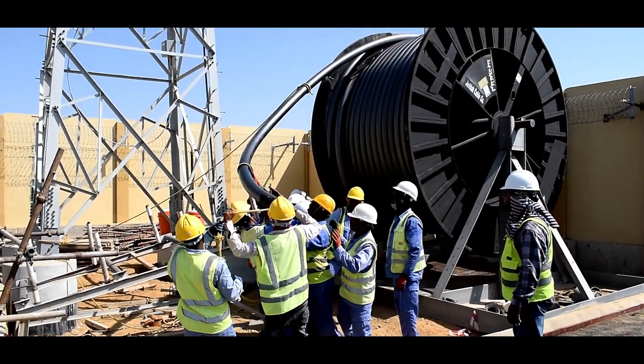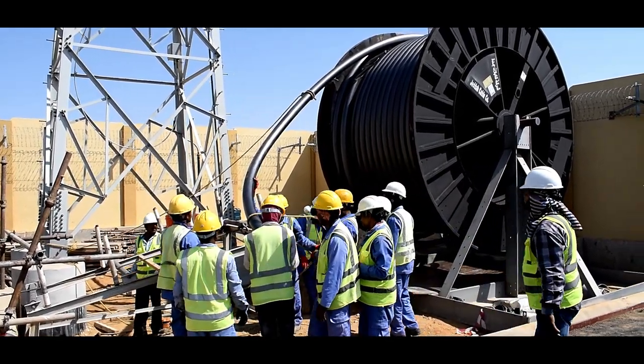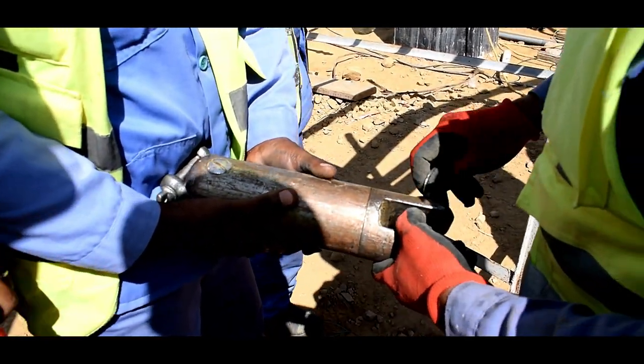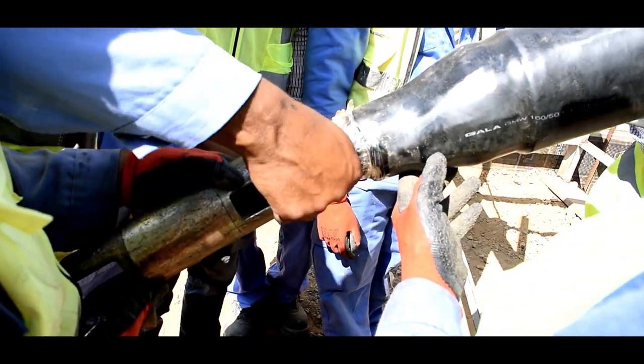Cable is slowly placed above the conveyor. The function of the conveyor is to keep the cable in a straight path and thus avoid touching of cable to external wall or surfaces. The cable eye is tied with cable wire with an articulated joint. The function of the articulated joint is to avoid twisting of cable during pulling.